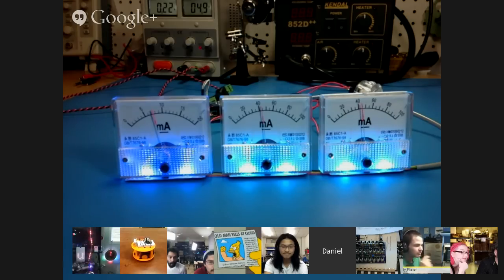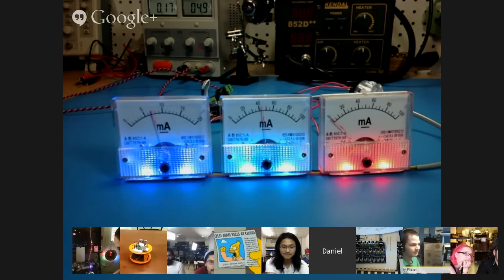Also, you'll see that it lights up, of course. It has to light up. There are a number of LPD8806 LEDs taped underneath each meter. In the current mode, you can see on the far right, the second hand, as it goes from 0 to 60, it cycles through the colors of the rainbow: red, orange, yellow, green, blue, violet, and then back to red. I've used that color idea on a couple of different clocks, and I, of course, wanted to incorporate it into this one as well.